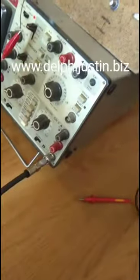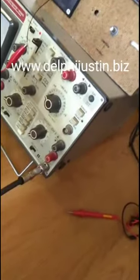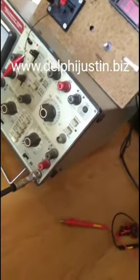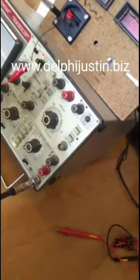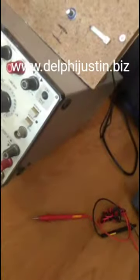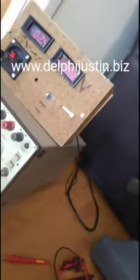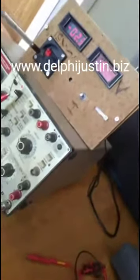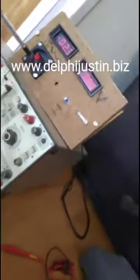And that's how it's gonna work. I don't know, do they make them? I think they do, Tektronix might have a 10 meg ohm impedance one. There are some that are 10 meg and some that are 1 meg. Mine's a 1 meg scope, luckily, so I could do this without having to use a 50 meg and a 12.5 meg.